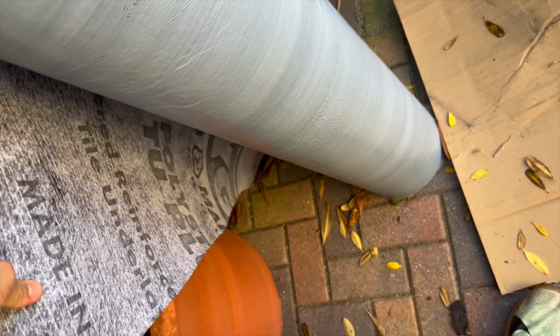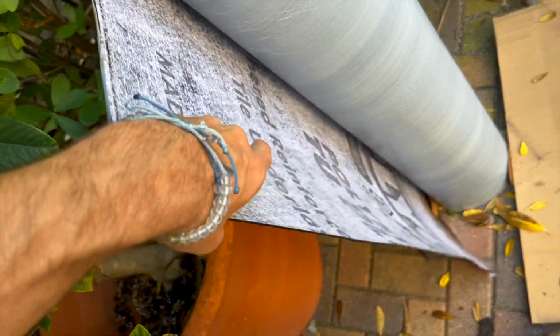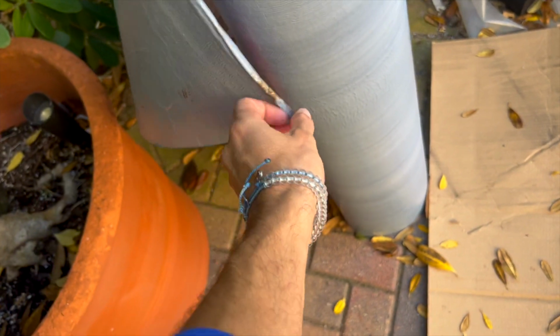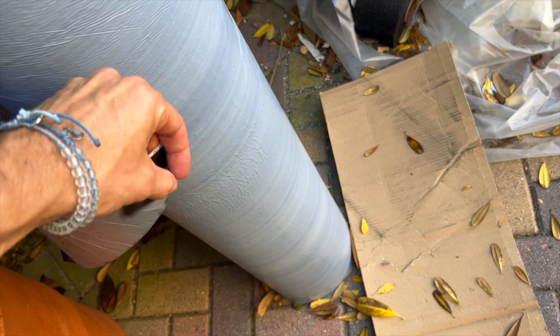Now you can see we have the white paper down underneath the tiles, which is Polyglass TU+. That paper has a little bit of fiber so that the foam will stick to it. Let me show you a roll right now. You can see here, this is an extra roll of the Polyglass TU+ that we have. You see it's got poly fiber on the top so that when we foam the tiles down to it, the foam will stick. This is a self-adhered underlayment, just like the MTS, where we peel this off to create adhesion. It's really sticky right now.